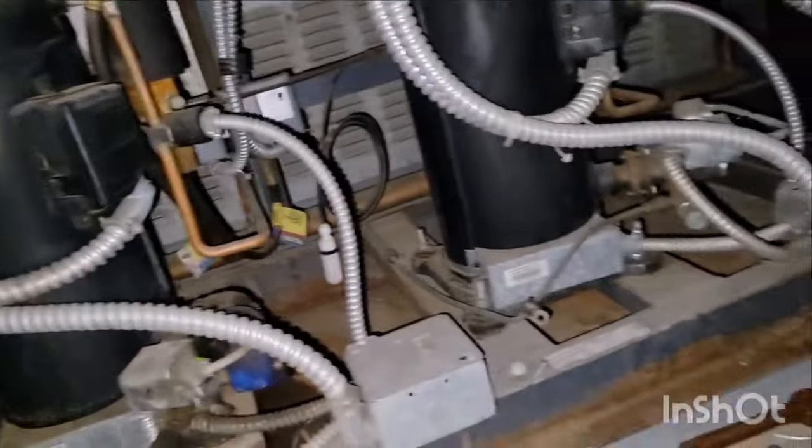All right. And you just want to go through and literally touch everything. Touch every hot gas valve. Touch every compressor. Do all that good stuff, okay? And just go through. Is it supposed to be hot? Yes. Is it hot? Is it supposed to be cold? Yes. Is it cold? Is it supposed to be warm? Yeah. Is it warm? That's what you do. And a lot of the times you'll catch a lot of these discharge issues dumping back into your suction.